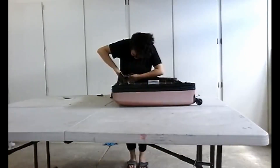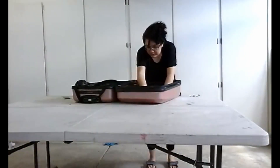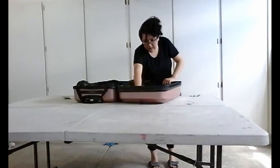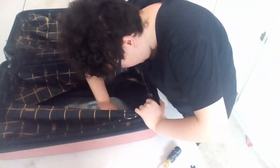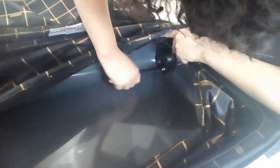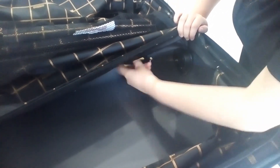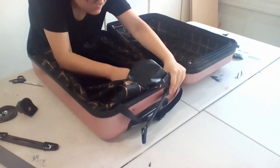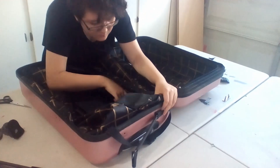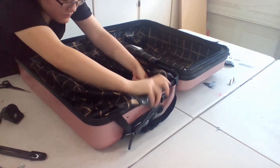The fabric covers turned out to be sticky felt pads covering the screws, so I scraped those off. After the felt pads are removed, we got to the screws and I started unscrewing all the wheels from the inside. The logo was held in place more firmly than just with adhesive — there were two metal clips that held the logo in the back. I moved those off and the logo popped right off. I also removed the handles but kept the collapsible handle in place; I'll just mask over that one so I don't epoxy over it.